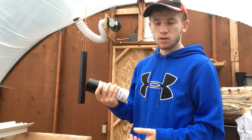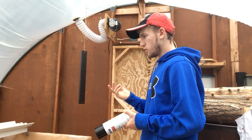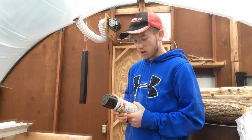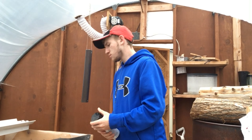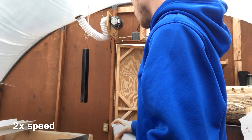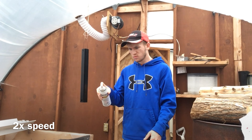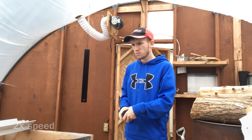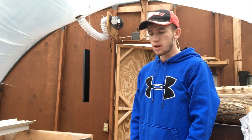It says use in open areas, so I'll turn my ventilation fans on and open the doors so the fumes don't get you. I'm not going to use any primer just because this is a small piece — it's going to be used for filming, not on the back of a truck getting beat up; you handle it like a camera. I got my ventilation fans and the back door cracked. Make sure you're not going to get overspray on anything. Give your can a good shake for at least two minutes and follow the directions on the back. Alright, so that's coat one.